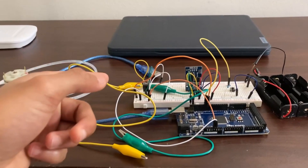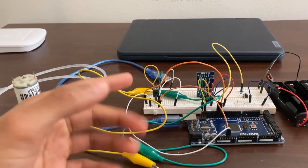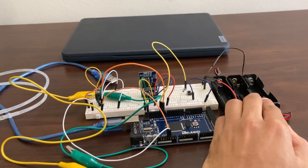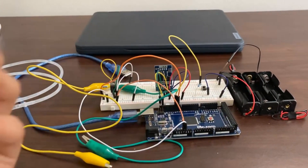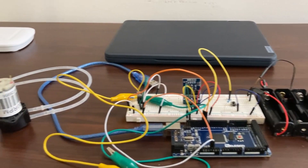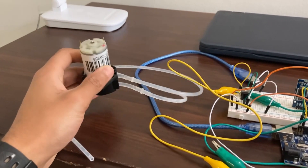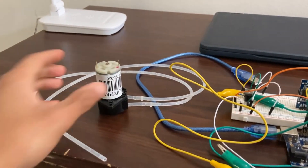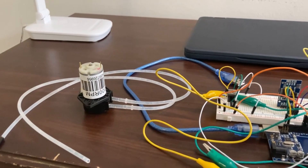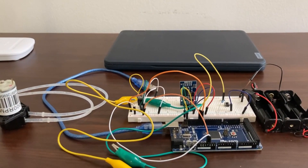This is the automatic plant watering system that I made. Overall, I think this project turned out to be a success, but there are a few things I would improve upon. For example, the power supply for the motor — since it runs on batteries, I have to keep charging them, which can get annoying. Maybe if the power supply came directly from the wall, that would be great. Another thing was that the motor was super slow — it took about three minutes to water the plant sufficiently. Replacing it with a more powerful or faster motor would be great. Overall, I think this project turned out to be amazing. Thanks for watching and I hope to catch you in the next video.